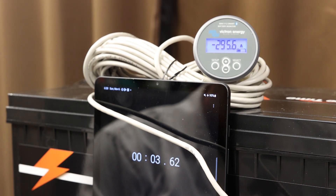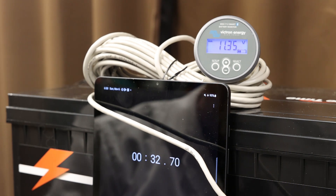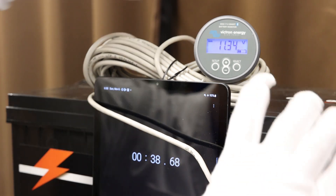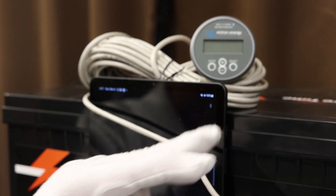Now what about extended run time? I want to test how high you can push it for five minutes before it shuts down. Let's try 300 amps first. There we are at 300 amps. The beeping is because it's pulling a lot of voltage from the battery — it's down to 11.3 volts and the inverter doesn't like that. That shows the BMS is struggling with this load, which it should be at 300 amps. One minute, 11 seconds — it thermally shut down. So at 300 amps, after about a minute, the battery overheated.